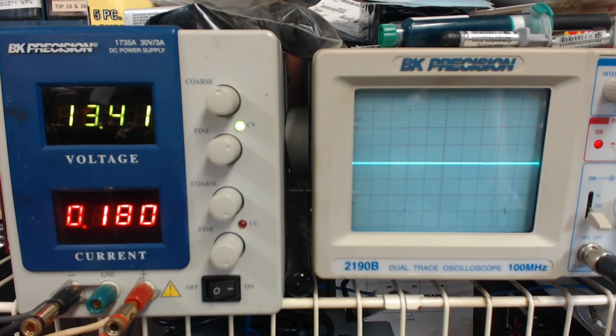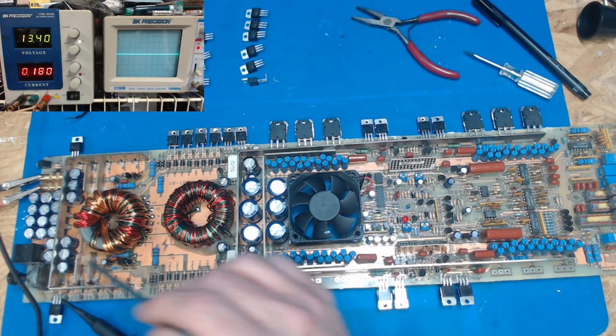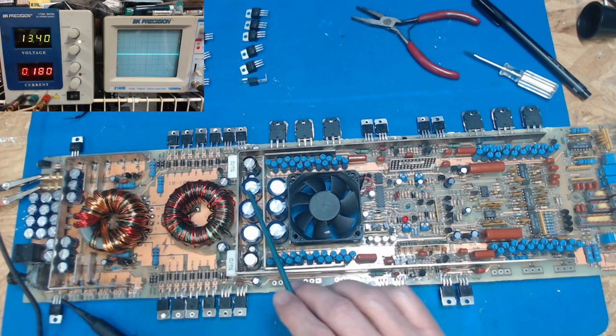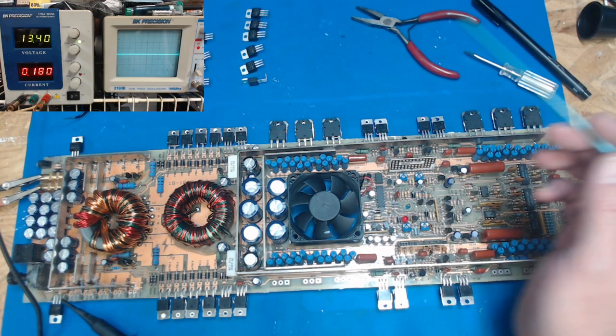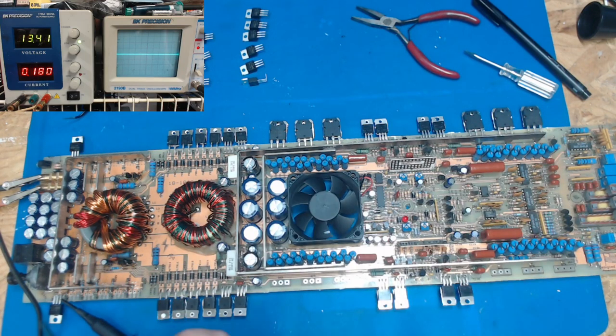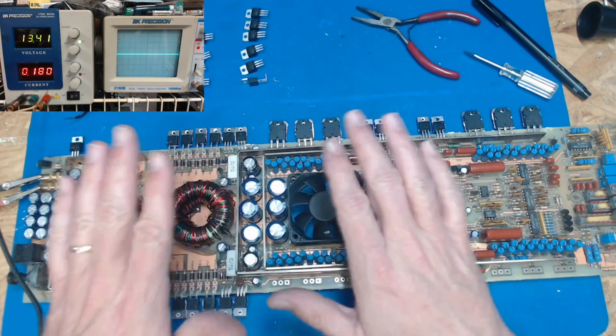And so, let's go over there. So this chip will fire up the power supply and charge the rail capacitors until it hits rail voltage. Once it does that, it actually dials back the pulse, which you've seen how little it got, while it's not using all that much energy. So it was just putting the tiniest pulse in there to keep the rail voltage up.